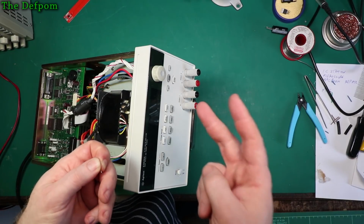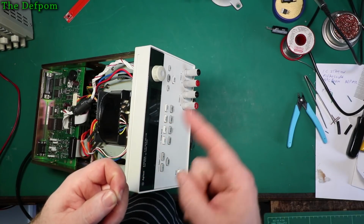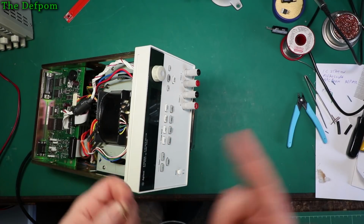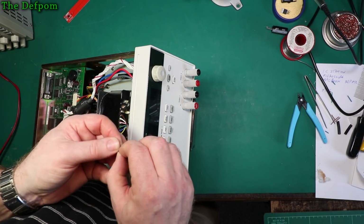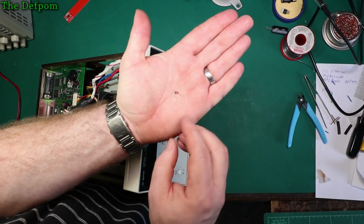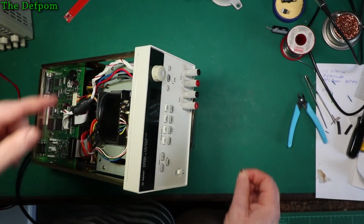The first is that when I put a capacitor on the board to try and smooth the input a little bit, I put it across the reset and the VDD pin of the IC, not the ground and VDD pin, so it could have been affecting it that way as well. But I took that off, didn't fix it. Then I did some voltage measurements and I realised that the Zener I'd put in, which is a 12 volt Zener, which is this one here, although in theory it should have been the right one, the voltage was too low on the IC.